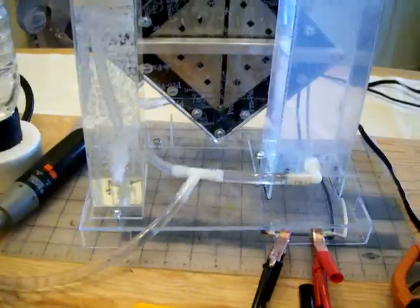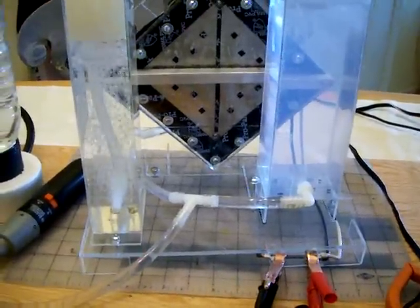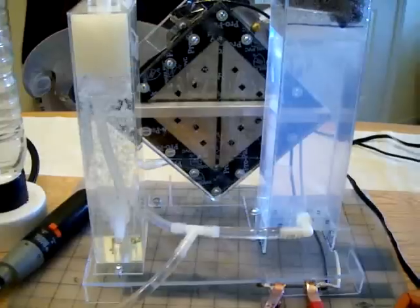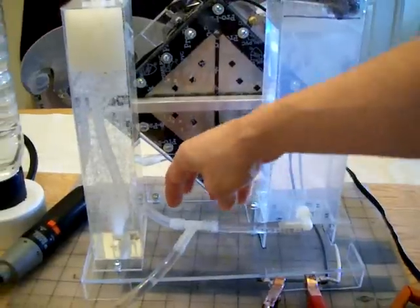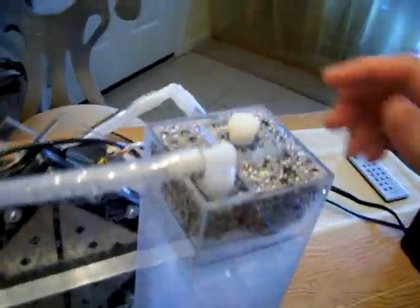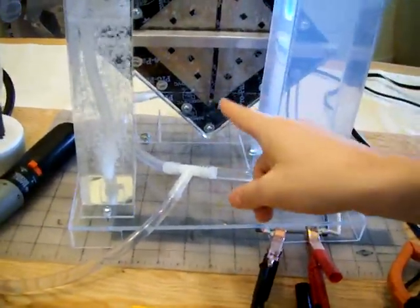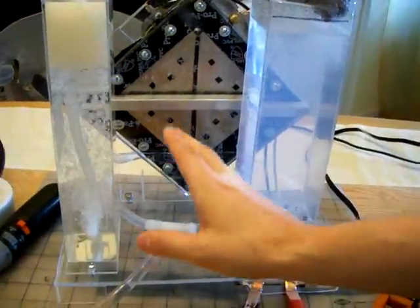The next modification I've ordered is a water pump, in an attempt to keep the water cool on the cell — not to cool it down, but to keep it at room temperature. The pump will be installed here. Right now without the pump, the water in the cell stays there too long, heats up, and goes back to the tank via the gas movement, so the tank becomes really hot. By adding a pump, the water won't stay long enough inside the cell to heat up.